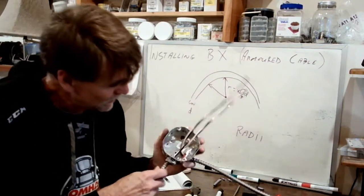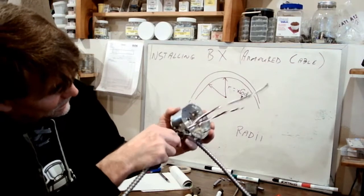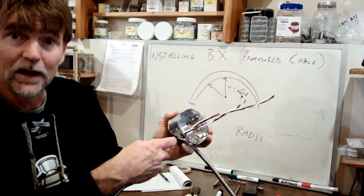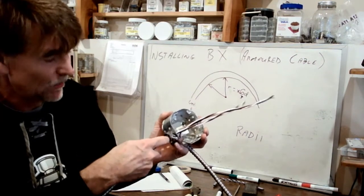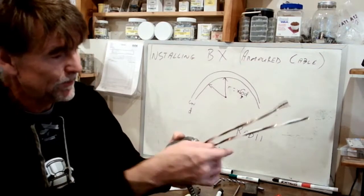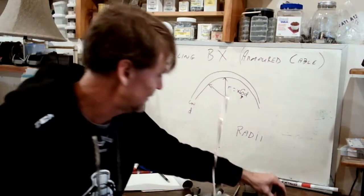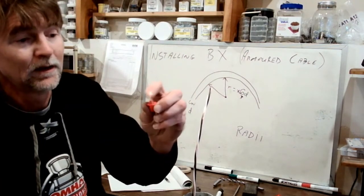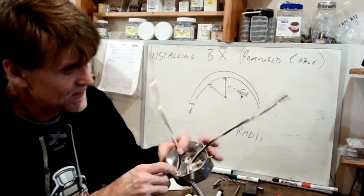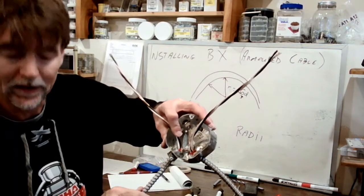Just like this. Now, in this case, we're actually holding the wire out here, so we don't need to worry about holding the wire on the inner conductors or the outer jacket. We're definitely going to be holding the outer jacket. What we need to have happen, look at what we've got on the inside. Notice that there's this little tab here on the anti-short. It's necessary that that little tab appears inside the box right there.